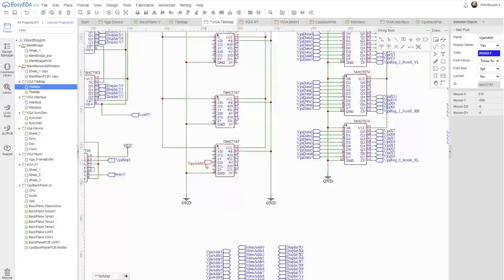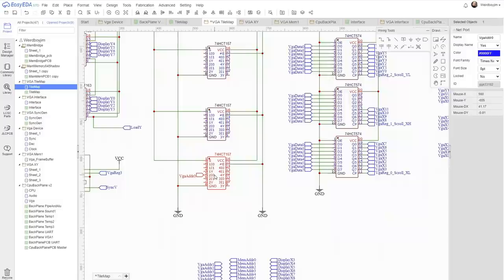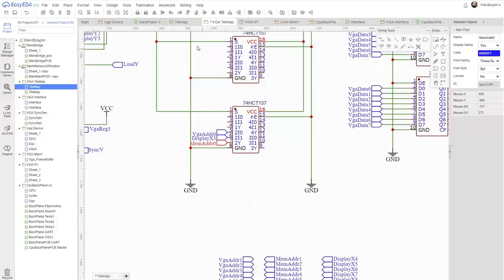Right, so the read goes low to signify the memory area selection for writing. So the address needs to point at the first of a pair, and the calculated location from the counters to the second, because that's going to be our default when that line's high. And then we take out the output that we're actually going to drive the address line with. Now I'm thinking alternates up here is going to be the right way to go.